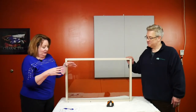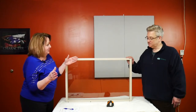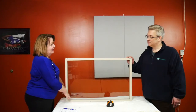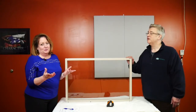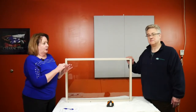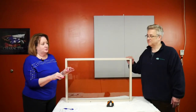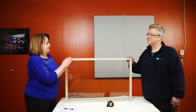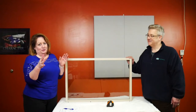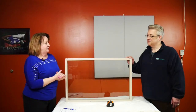So now we have the width is 39 3/4, and the height is 26 1/2. We don't need a depth measurement because it's outside. Right. We're all set to order that blind. Just remember, make sure you document the room that you're in, taking the measurement, and which window. And remember, Joe, we're starting left to right. Left to right, 1, and continue around the room, and then continue through the rest of the building, just notating where you're at.